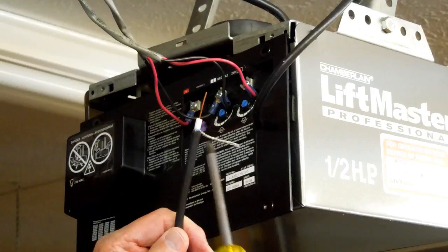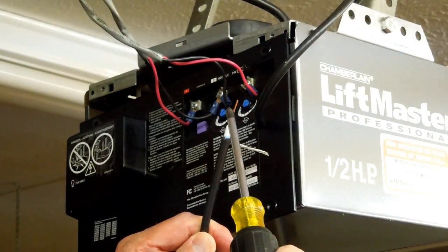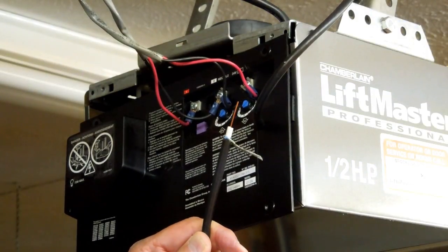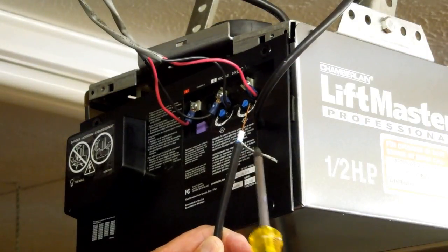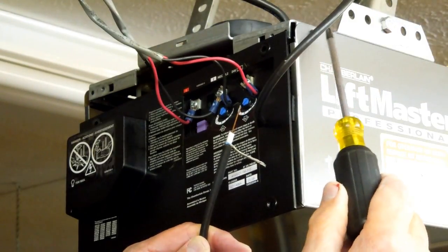What I did was cut that coax like this, soldered this to the circuit board, and cut this foil and the shield off. Had I found it necessary to connect this to ground, I could either strip this back and make this longer, come over here and connect it to a screw — something that's metal.